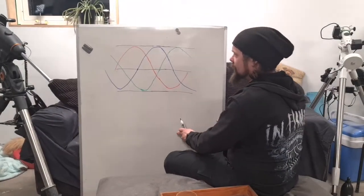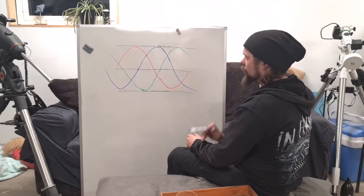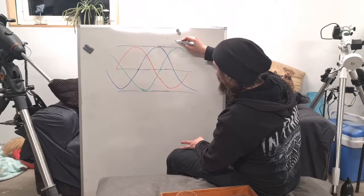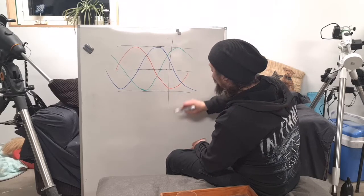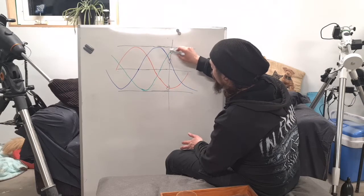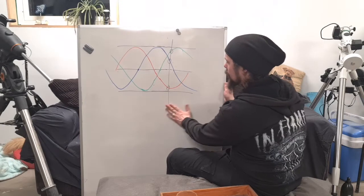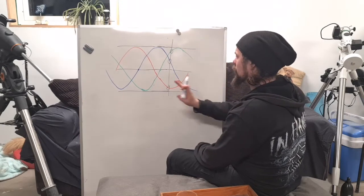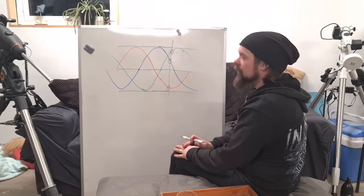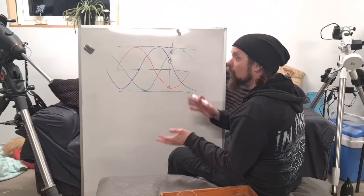Remember these guys? The phases that we use to control the motors, sinusoidal form, perfect harmony. If I pick a point here, any point, the strength in that field is the same as that one plus that one. At that point, it's in a stall position, held right in that location. Perfect, if everything is perfect, if the balancing is right, there are no cable snags, there's no wind, anything.